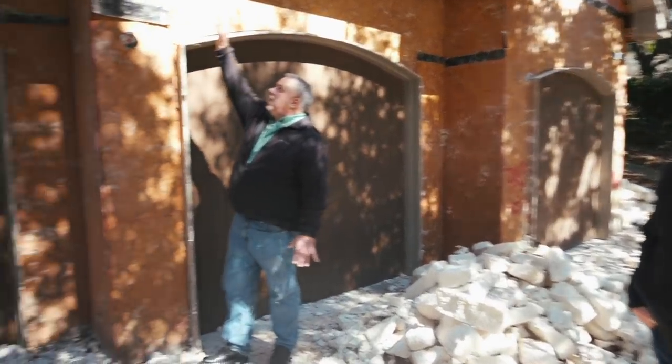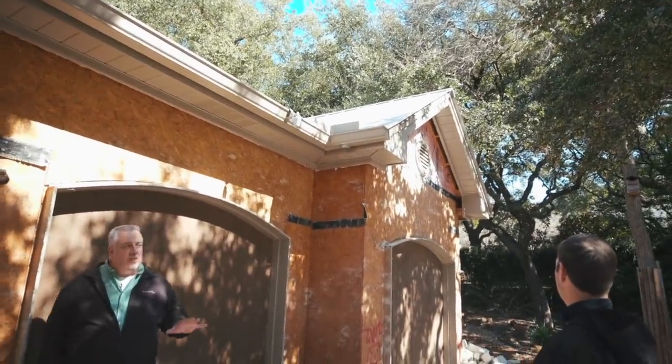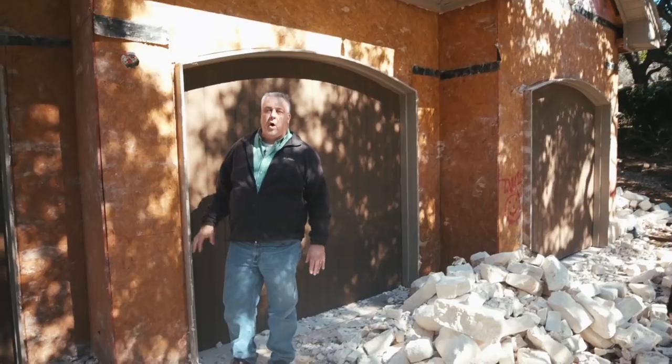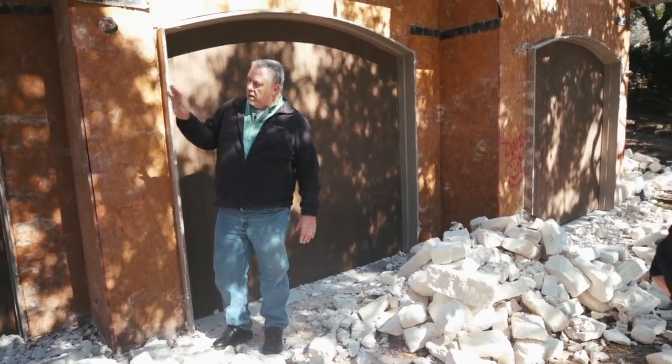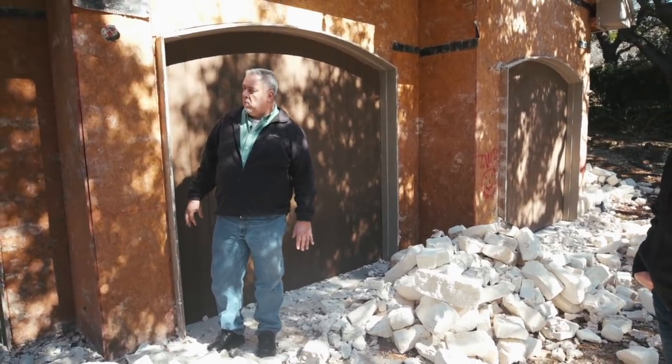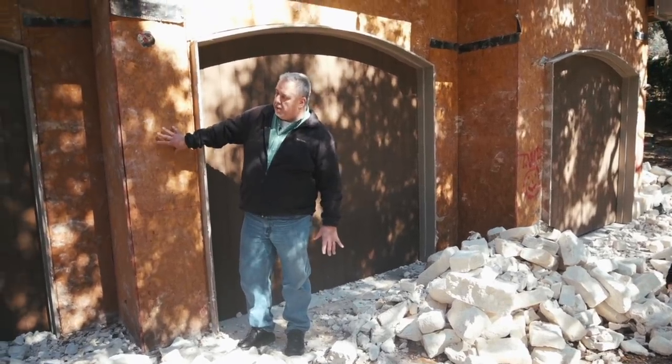Well, first of all, if you look up high, we've got roof gutters, we've got good overhangs, even on the rakes. So initially, we're taking a large portion of that water load that comes down from the heavens and taking it off the house - only a small portion is actually being seen by the wall. There's a saving grace that it doesn't have the building paper. When we go inside, my guess is there's probably no insulation in the wall - a lot of the success of this building is because it was so poorly built that it survives very easily.